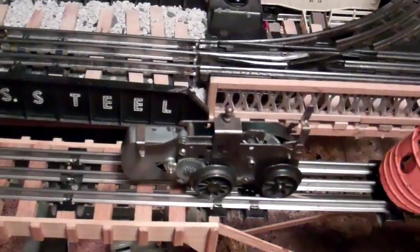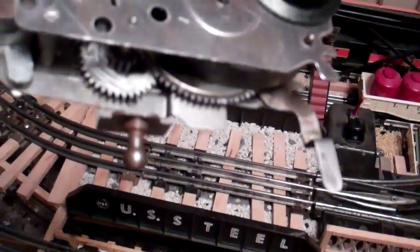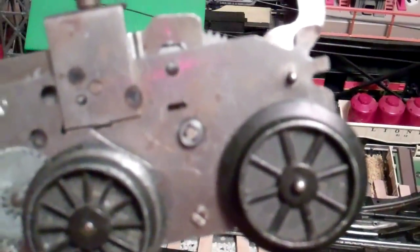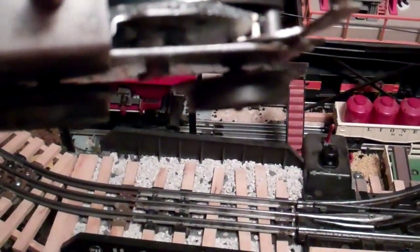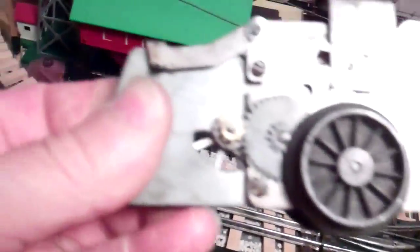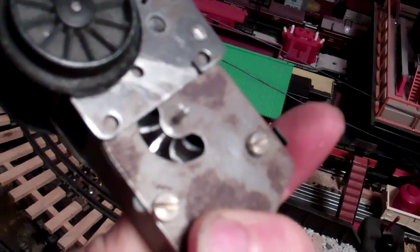When I got this, the motor just didn't work. There's a large gear there — I remade the entire gear. The ratcheting for the wind-up, the spring mechanism that they used, was broken so I made a new spring mechanism. I made a couple pieces for the intermediate gears, the gear that drives the impeller, and I had to make the impeller also.